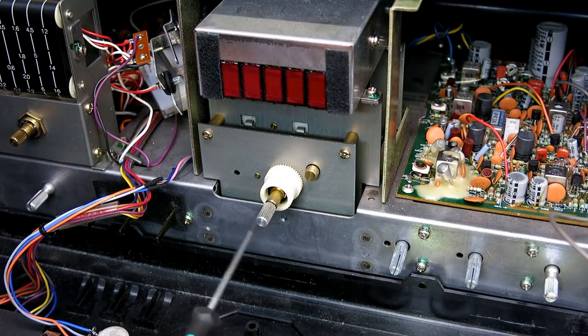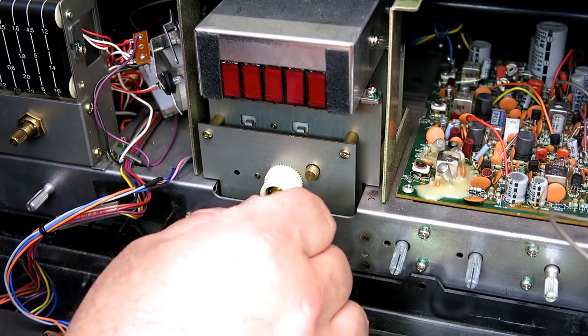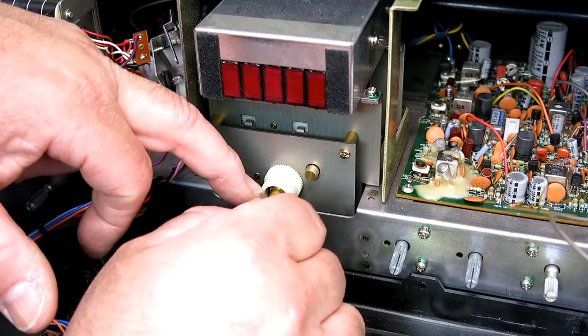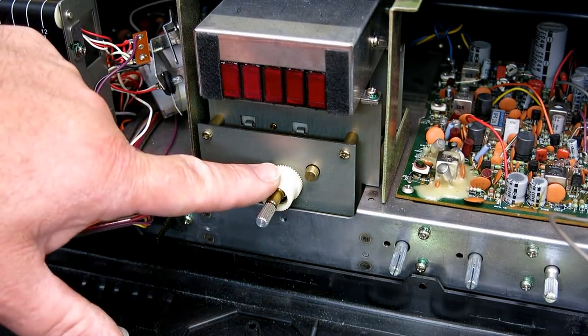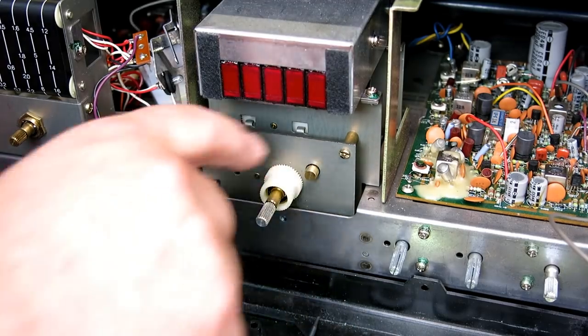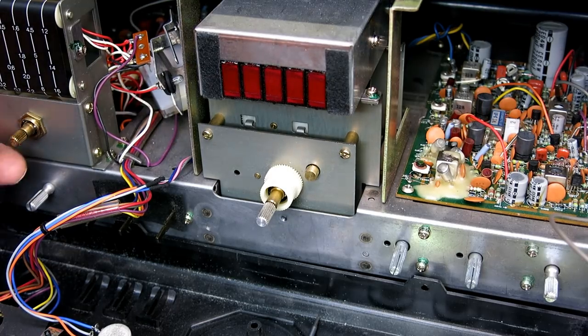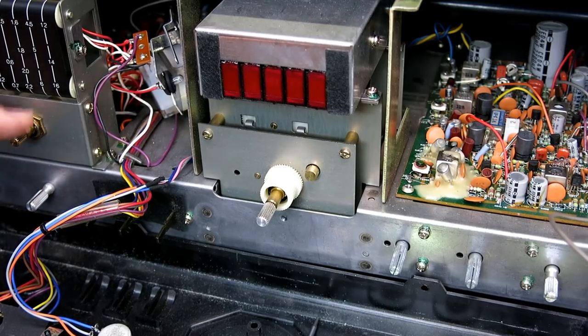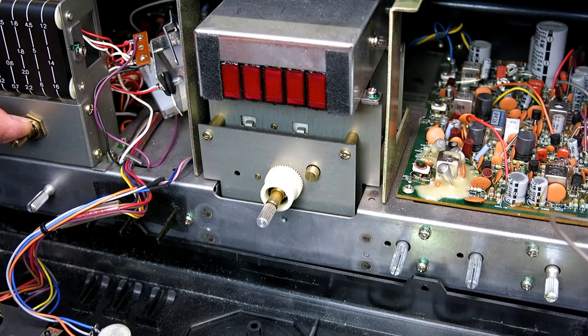What's interesting is they have ball bearing coaxial gear speed reducers. When I turn this knob, it has a gear reduction to the potentiometer, which is neat. There's several examples on it — one over here, one here, and one on the back side. There's some magic going on behind it that I don't want to disturb, so I think I can do the repair on the front side. These little speed reducers are actually very clever — let's zoom in and get a look at how that works.